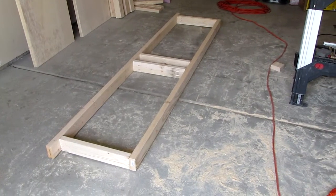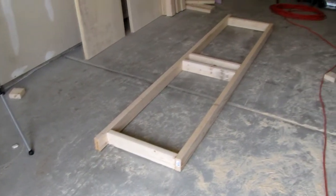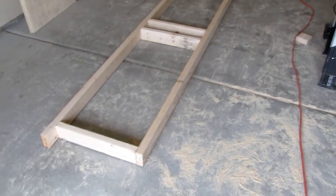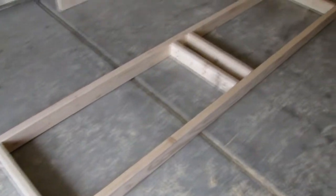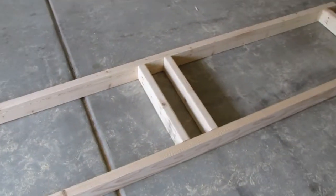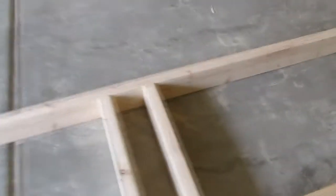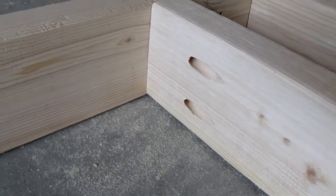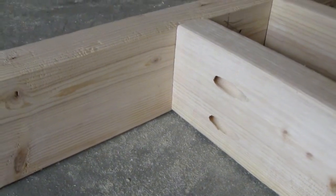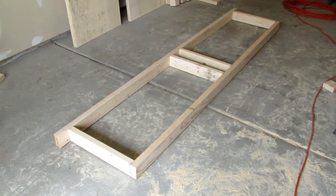Here's the top piece. As you can see over on this corner, the back is slightly longer than the rest of this piece — that's so I can have a three inch lip. I wanted this back piece to extend all the way to the edge of the workbench, but the rest I wanted a three inch lip. There are two pieces here because I kind of just winged this plan, and in order to make it work I needed a support that goes all the way through — which you'll see in a minute. It's put together with pocket holes and screws, pretty simple.